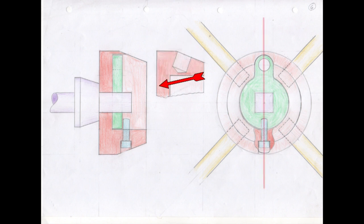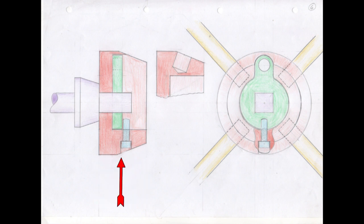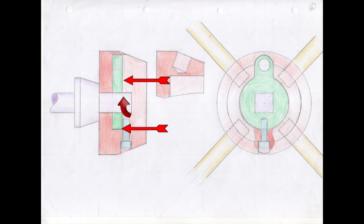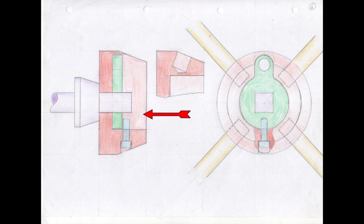This view is a section through the hub. Our redrilled centre sits just here. The recess the locking plate sits in is 18mm deep and our next task is to start to machine it. At the moment the hub is approximately 35mm deep — that's an inch and a half — and it needs to be turned down to 25mm, just under an inch. The plan is to remove material from the centre with a large taper shank drill, then cut back the front face until the overall thickness is down to 25mm, and finally use a boring bar to open up the hole to 18mm deep and 25mm in diameter.